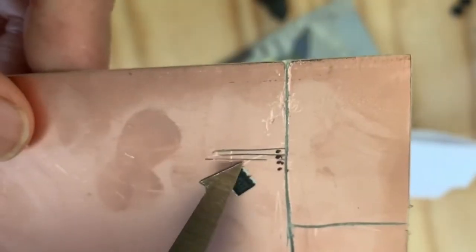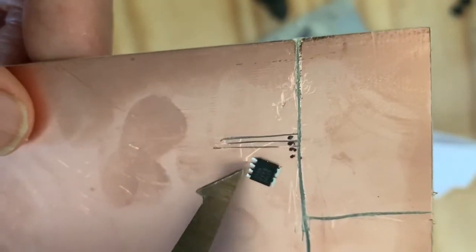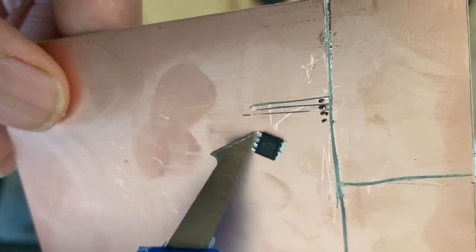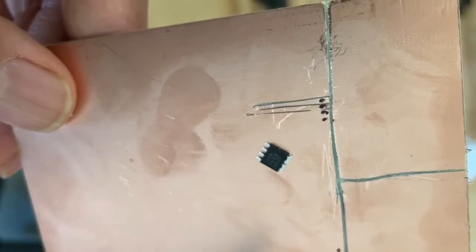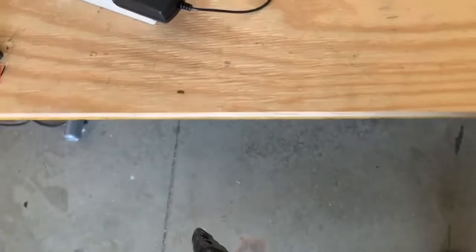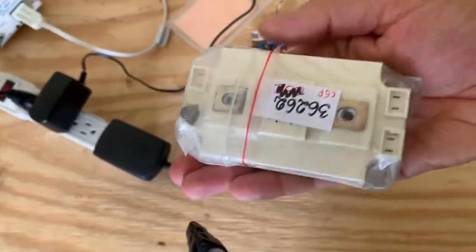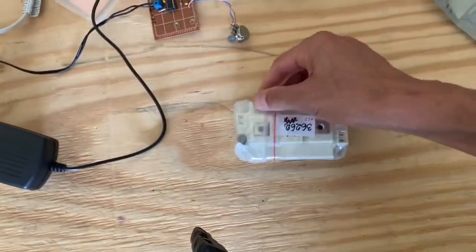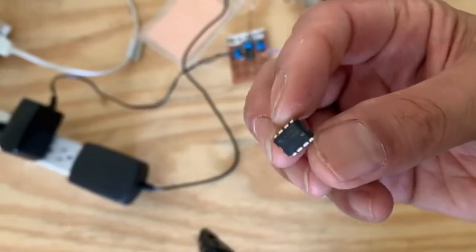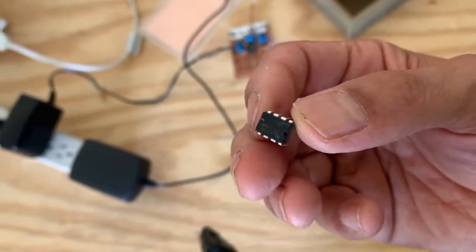What I'm doing now is scratching in PCB tracks for this tiny MOSFET driver chip — it's actually a PN pair of MOSFETs, and this can drive really large transistors, which is why I want to make this board. It would be impossible to drive something like this with a small UCC37322 chip pair; those things get really hot and just burn up.